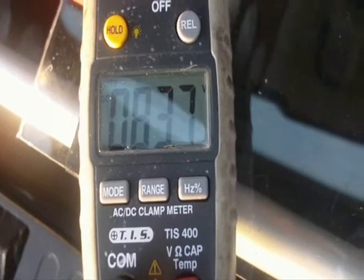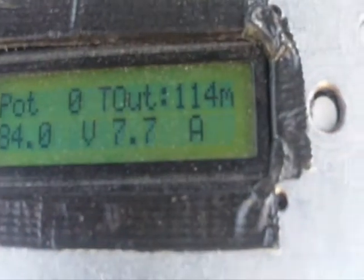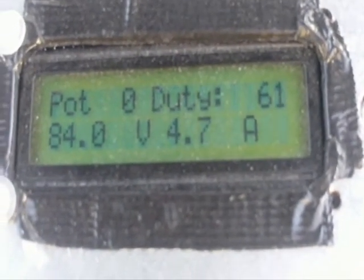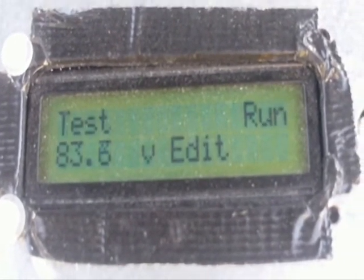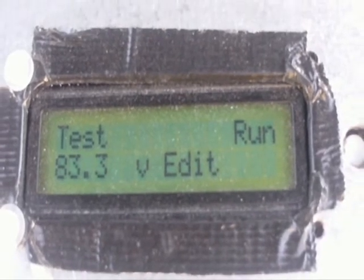Just now that the current is tailing off, back up again to try and catch the point where it actually shuts down. There it goes — current through 4 amps. That's the contactor dropped out. And we're done. Our pack is charged.